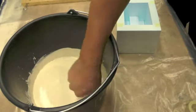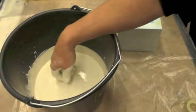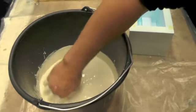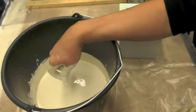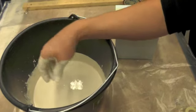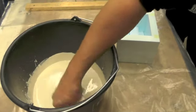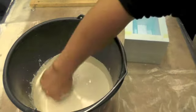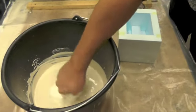Now you see the colour — the colour of plaster is white, a little bit yellowish. But you can use a sort of pigment powder — what they use to give colour to paint — you can buy it in a painting shop. You can add this to the plaster, but just very little, because if you use too much you break down the plaster-water system. You can see in the models I showed they're all a little bit grey — I used a tiny bit of black powder. A little bit means just like a coffee spoon — really a little bit. You have to experiment with that.